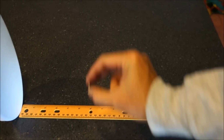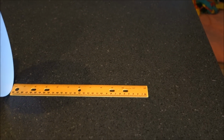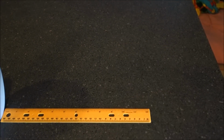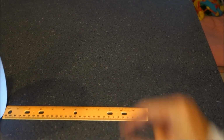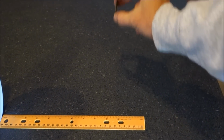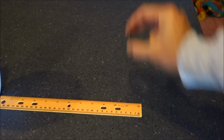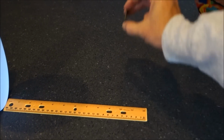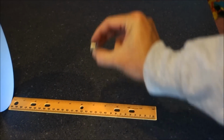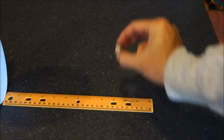All right, here we are at silver dime. 7 inches, starts to drop off to about 8, 9 inches there. Quarter, we're getting small whispers at 9, and it's dropping off, 9, 9.5. Half dollar, we're looking at getting whispers at 10 still, and 10.5. It's starting to really drop off. 9.5, 10 we'll say, and a nice pretty thick silver ring here. All right, so we're looking about 8.5, 9 on that.